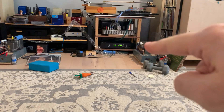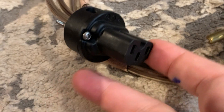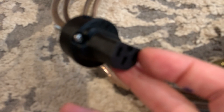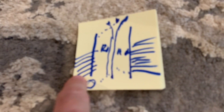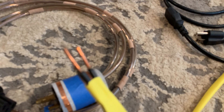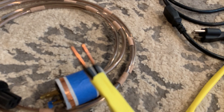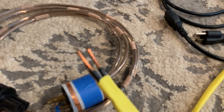So what I did with my amplifier is that in its IEC socket, when the power comes in, inside the amplifier I connected the safety ground and the neutral together. Why? Because on the panel they are connected together, so I am using the safety ground as a booster shot — basically doubling up the current capacity on the neutral side, using the safety ground as well for neutral carrying capacity. And that results in a quite serious boost in the bass and in the fullness of the sound.